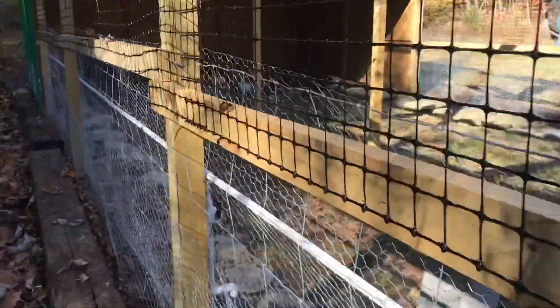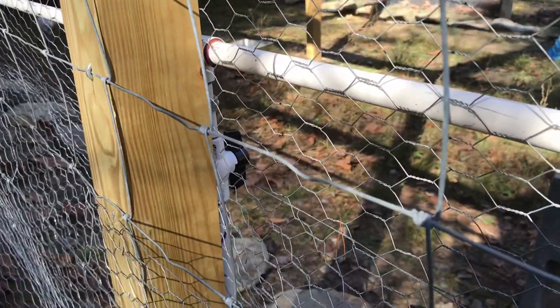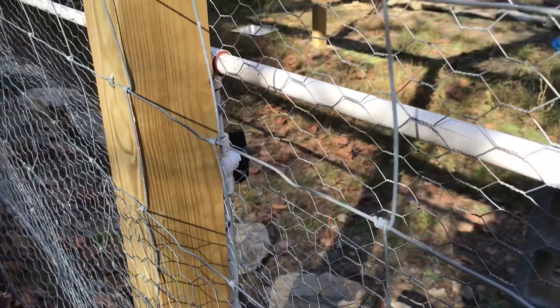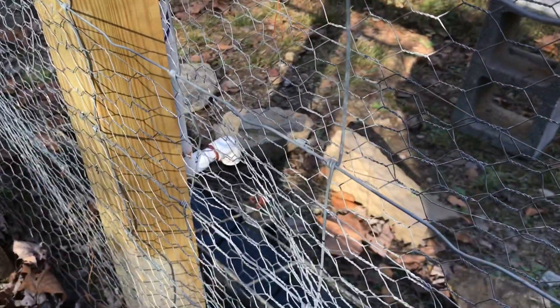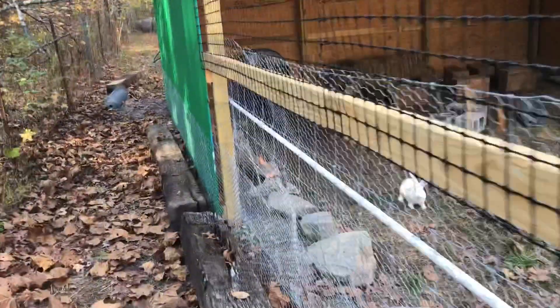Right now there's not an end on it, but I can put a bowl under that too. We'll finish putting spouts. The big thing was hitting the down spouts so that you could shut the water off up pretty high, so you don't have a lot of standing water in there. And then once you turn the water off, you let all the water out so that nothing freezes.